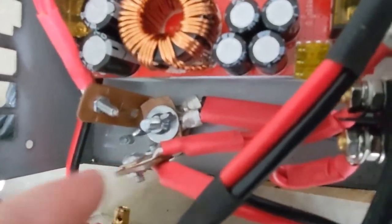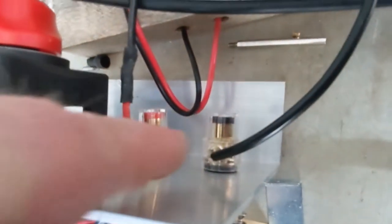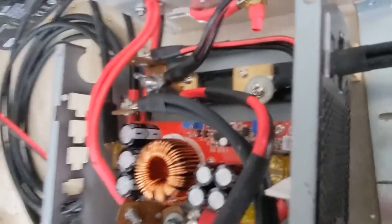Let's run through the quick specs. Coming in on the left hand side we have a homemade terminal for the positive side. In parallel we have the inverter, the wind charger, and the DC battery charger — all in parallel. Coming off that we have the main key component of the system, which is a boost controller, a boost charger. What we do is turn our 12 volts into 90 volts.